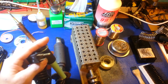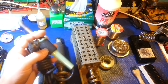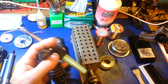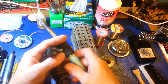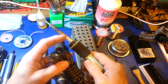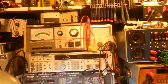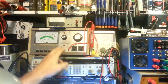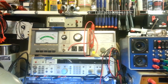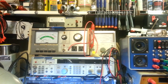One disadvantage of this standard soldering iron is what's on the end — a plug. It's non-adjustable for heat. You can get a small auto-transformer power supply for your hand soldering iron, plug it in, and adjust the voltage going to the iron to raise or lower the temperature. This power supply on the back has another plug with a knob that controls output power and tip temperature on this iron.